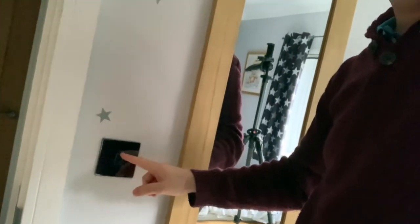A slight complication for our setup is that I have two lives behind this light switch. It's a single gang switch, as you can see, but there are actually two power cables going up into this light. One feeds the light and the other does the fan. So behind the light switch I'll have a permanent live going to the fan controller, which is a Sonoff iFan 03 that is already connected to the HomeKit setup. And the switched live, the one that's actually controlled from the switch, will go through this Shelly into the light power.